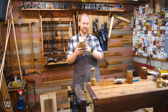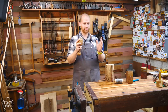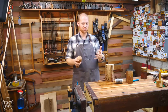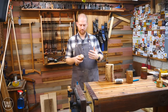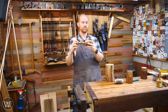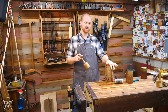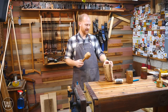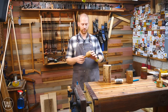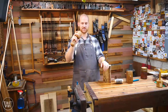Starting off with this block of live oak and now having a tool — I am really loving this stuff. It turned far easier than I was expecting, and part of that was because it was green. Green wood is always far easier to turn; it has less tendency to be grunky. The dry ends of this were very difficult to turn, and I know if this were dry it would be a very hard wood. The planing of it — well, the grain goes every direction, so it is a difficult wood to work with. But holy cow, is it so worth it. This is just absolutely gorgeous and I am really looking forward to using this more.